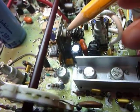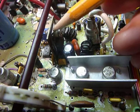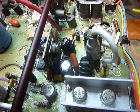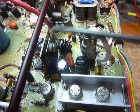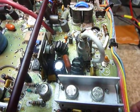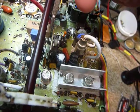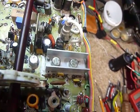That happens because the corners of the transistor tab will punch through the wafer. I use a different kind — the gray wafer material that doesn't need heat sink grease because it's impregnated in the material. If you just take it off and flip it over so the transistor contacts it differently, that works too. When you tighten the screw, use a very small screwdriver — like a jeweler's Phillips — and don't over-tighten it. I put a tiny dab of clear nail polish on the nut and bolt so it doesn't come loose.